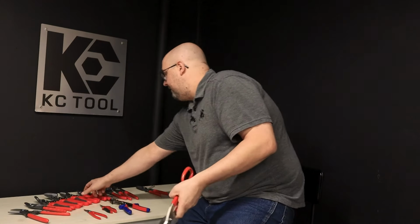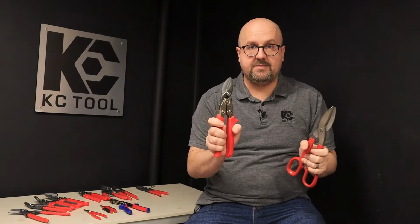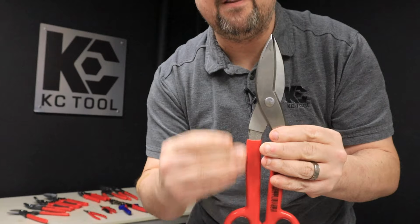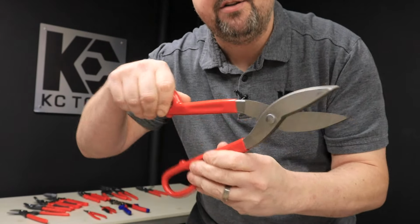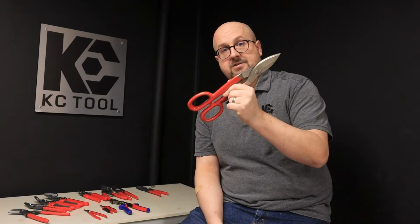The easiest difference to see between the tin snips is the difference between your standard tin snips and aviation snips. These are what we consider a standard design for tin snips. It's all about the length, and the length of the handle especially, that creates leverage when cutting into metal. Depending on the materials and thicknesses you're cutting, a lot of people prefer the conventional style.